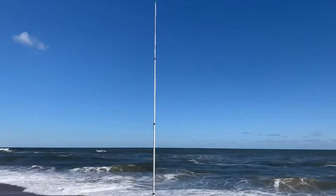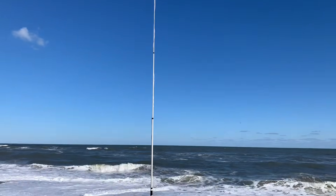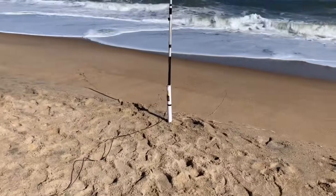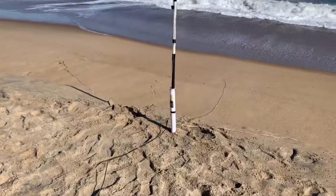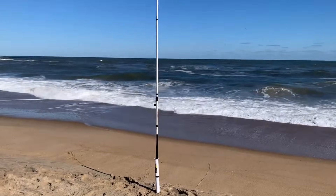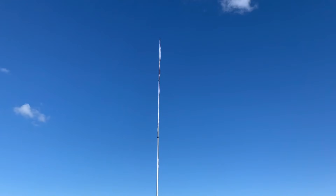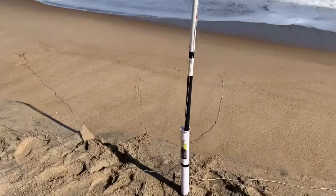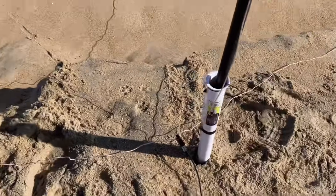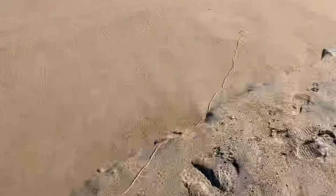So there are my thoughts and feelings on it. I've built this antenna and it's so easy to build. Get what we call a squid pole — a fiberglass fishing pole — tape a piece of wire to it, about 17 feet or roughly 5 meters, whatever it measures out to for your target band. On the 20-meter band, it's really easy from 20 down to 10 meters to build this. Just tape wire to it, put a ground plane below it, and start making incredible DX contacts.